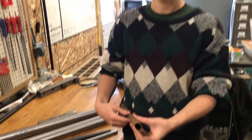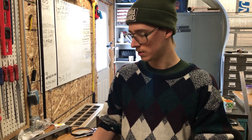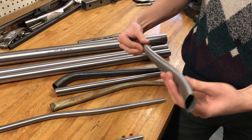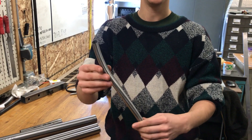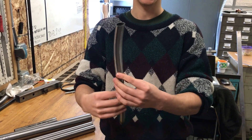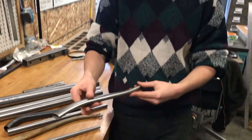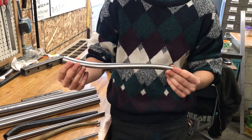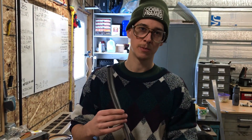You could maybe do those things yourself if you had all the tools and equipment, but most frame builders are just looking to put the tubes together custom for their customer's spec. They don't need to own all that equipment if it can be done for them. This one is an ovalized chainstay — it's bent along the oval part of it, which is a very tricky bend to do. You need bending dies that hug the shape of that oval. It's also tapered over that same length, so this would be tricky without very specialized bending dies. It's great that this comes with the S-bend already put on it.